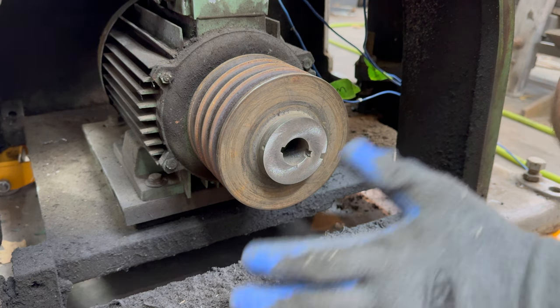The four leveling feet holes on the motor side, I was able to use a torque wrench to pull them out. In the process, I kind of galled the threads a little bit, again, because these were not perfectly straight. This is the straightest bolt that I have. I cut some slots on the tip. That is so it cleans out the threads. Running it through now with a little WD-40. And that cleaned it up real nice. So now we're all clean. Perfect. With the leveling feet side quest out of the way, it's back to stripping.